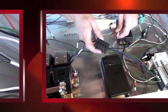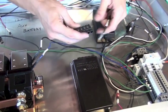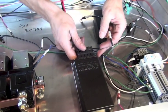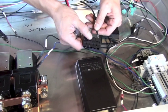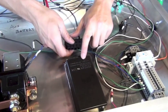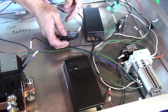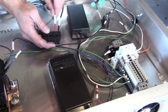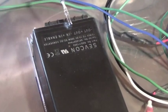Next, we'll wire in the DC to DC converter. If assembling your vehicle for the very first time, you may need to assemble the plug that goes into the DC to DC converter. The first wire into the plug is the 12 volt minus, followed by the 12 volt positive coming from the DC to DC. The parts are labeled on the actual connector to guide assembly. Next is the negative pack in — coming from the larger traction battery pack that charges the 12 volt battery — and then the positive side from the pack.